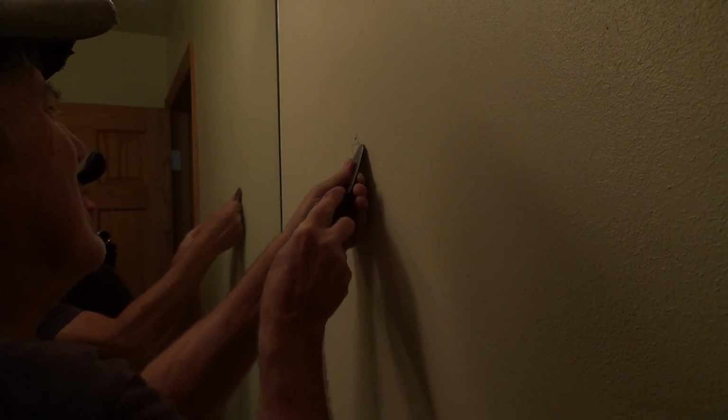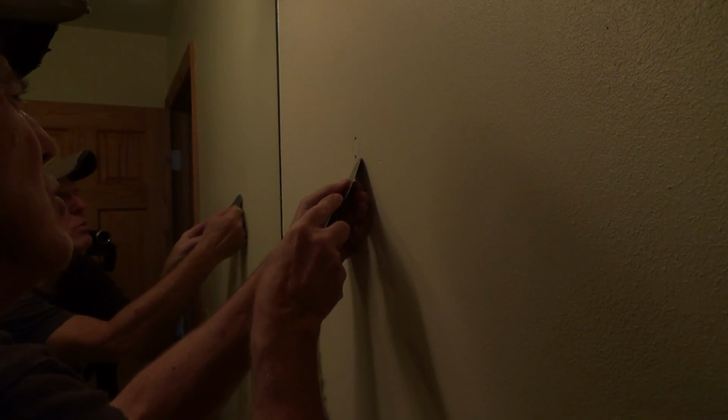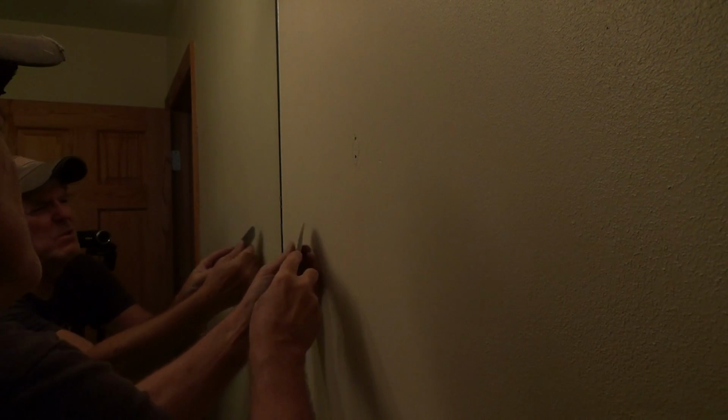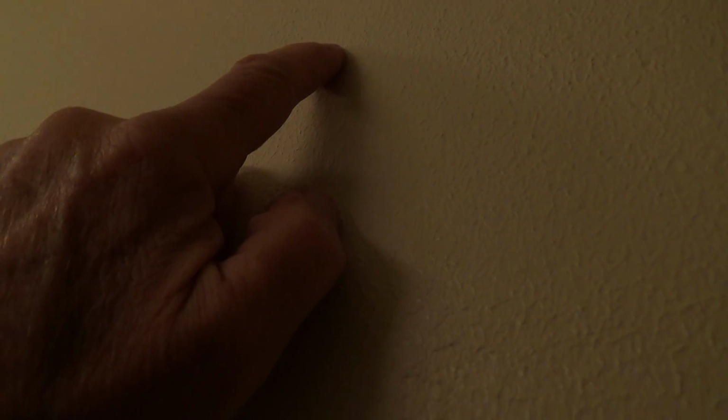Okay, I can clean off that excess, and I'm not going to putty up those holes, because my bracket still goes there, right? I do see a little mark there that I'll put some putty on. I see some other marks. Once you start going, you'll start seeing more things. See that and that? If I see it and I paint over that, guess what? Anybody else is going to see that. Is it my responsibility when I'm painting, even for a friend, to go ahead and fix something like that if I see it? Yeah, that's what I'm going to do. I'm going to fix it.